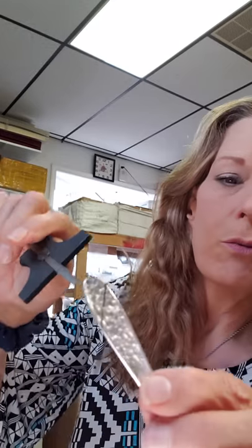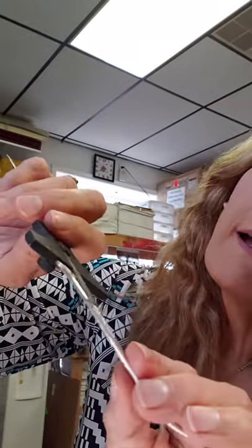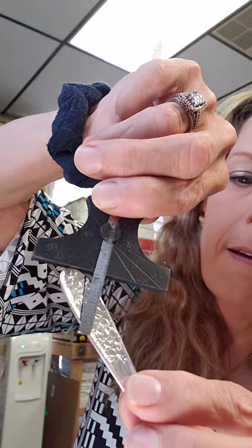So this here is 27 millimeters. And where I have drawn my line and the length of 27 millimeters, I'm well within range to be able to fit it into the miter vise. So I'm going to cut these pieces off with my mini bandsaw. You can cut them off with a Dremel cutoff wheel, jeweler's saw, whatever works easiest for you. Then I'm going to come back and show you how to do the filing on the miter vise.